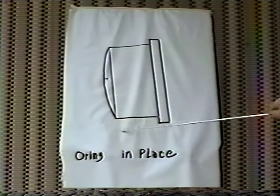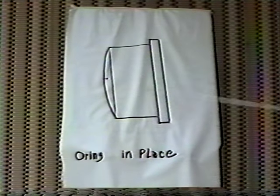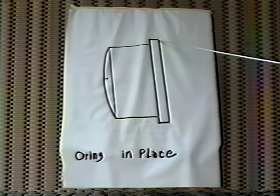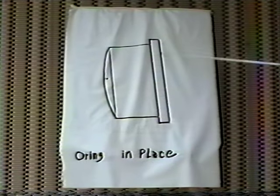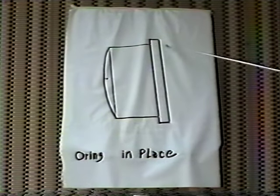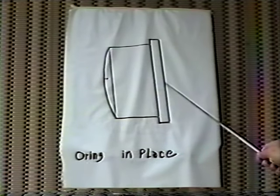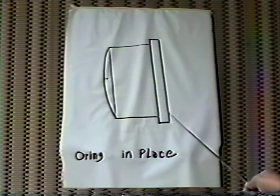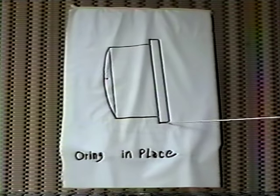Take the barrel with the ring, now that's all attached to it, put the unit into your lathe, and dress it down to a diameter to your original plate on this side. Because we made this 3/16 of an inch thick, which is thicker than the tooth, we want to dress it down so that it's nice and straight with the barrel. We also take and dress down the OD.